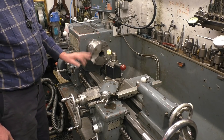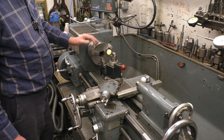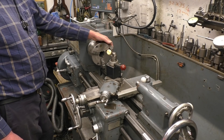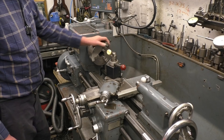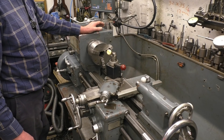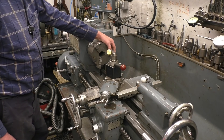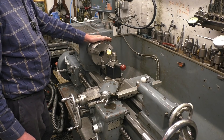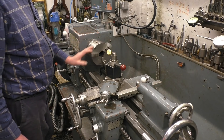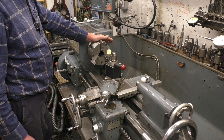This part here is the chuck — that's what holds the workpiece. There are various types of chuck: four-jawed chucks, three-jawed chucks, collet chucks, and face plates. I'll go through some of the different methods of work holding once we start to use the lathe. There's a big three-phase motor down the back which drives through a couple of belts in the gearbox, and this goes between 32 and 2000 RPM. I normally use 1000 RPM as high speed and then go down to about 250, but we'll do feeds and speeds a little bit later on.